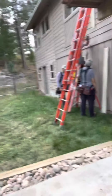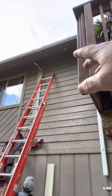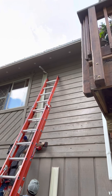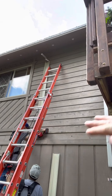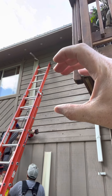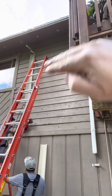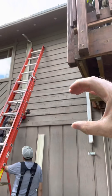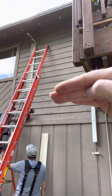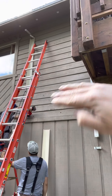We're up here in Evergreen right now. You can see we have the line set and the drain out. If you look at how we did the drain — the drain is on the bottom of where the refrigerant pipes are. You want the drain below. So when we drilled our hole out, we actually drilled it a half inch lower than the hole on the inside of the house. That's going to give us that little bit of slope as we exit out the home. You don't want to have it the same level — some guys even make it have a little rise right there. You don't want to do that. You want to have it below so you've got this natural drop.